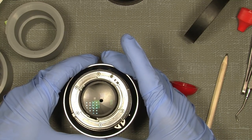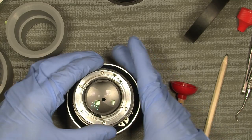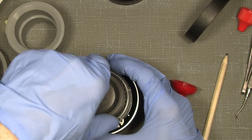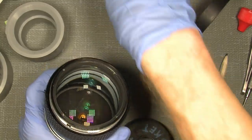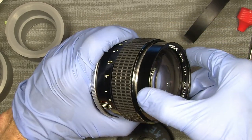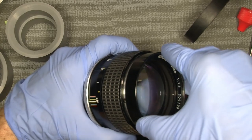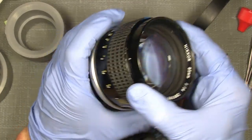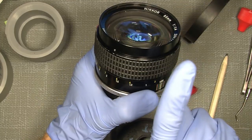And hopefully try to catch the correct one. So, does it work? Yeah, works. The aperture is working, so good. Focus ring to near end. And the ring goes on, the name ring. It says click somewhere. Come on, click. Then screw it in. Take care of the little set screw, because if you move the focusing ring, you could damage the hole in here. So take care of that.